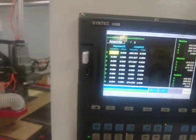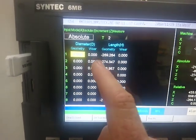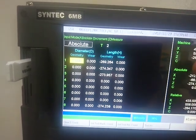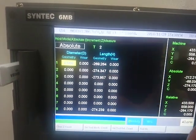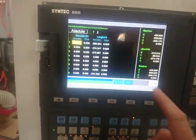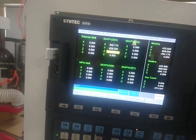We've got tool number two showing 274.347 in the tool set, and over here we've got 274.170. Now over here it reads 264.170 — so it does have an absolute 10 more. This is the machine one we're using right here, so we have to subtract. 274 minus 264 is 10, and 347 minus 170 is 177. So that's pretty easy — 10.177 is what we get when we do that subtraction.